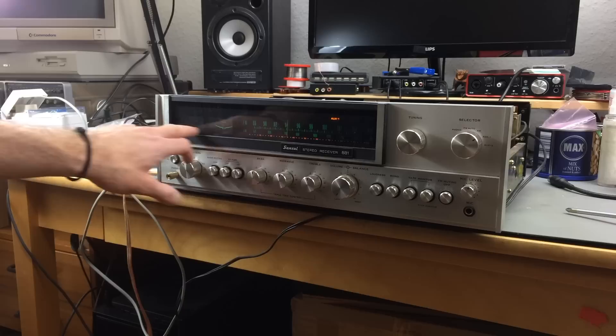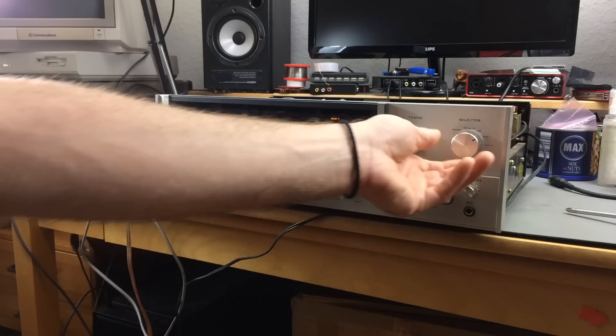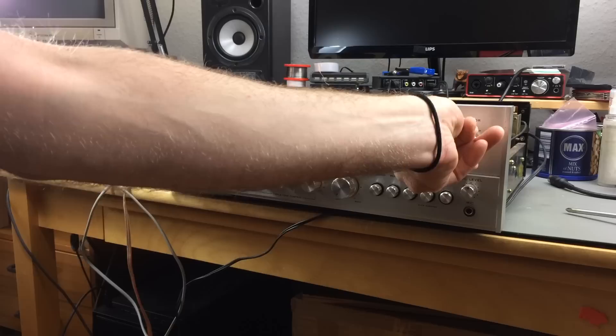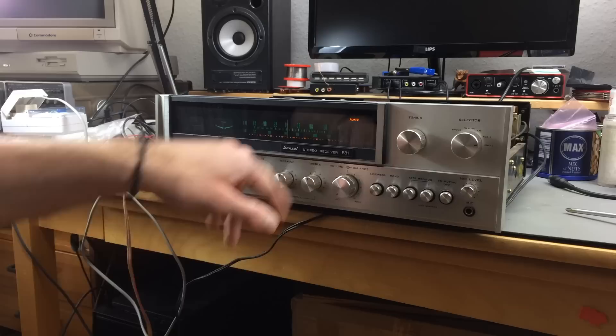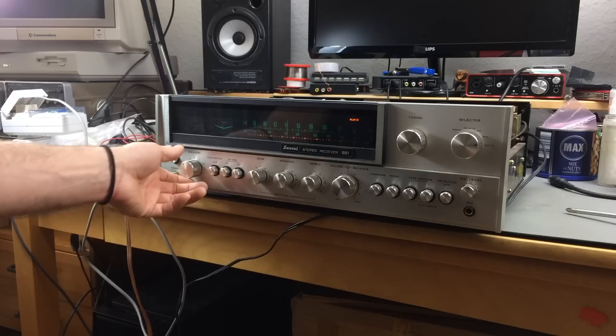The lights - this light is off, there's one light missing here, so I'm going to replace the lights. I think the indicator lights are all there. The tuner light is a bit brighter it seems, but those are all there. The top row of lights is all there. The scale lights have to be replaced. The hum probably comes from some leaky capacitors in the power supply section.